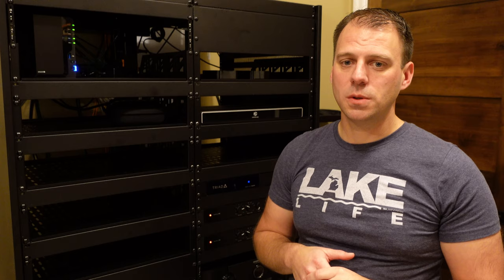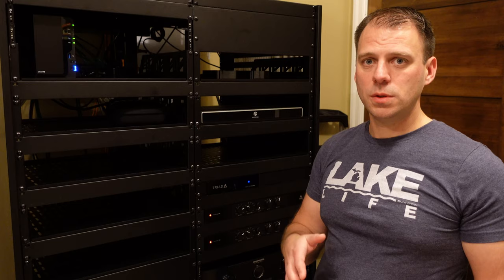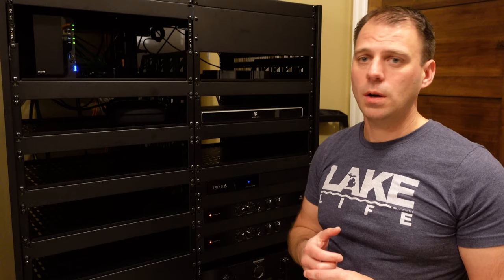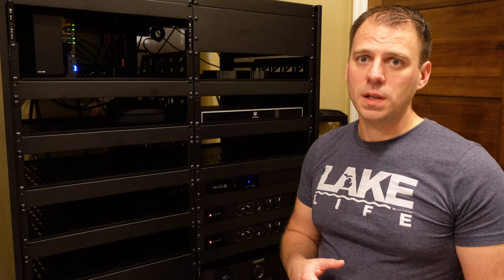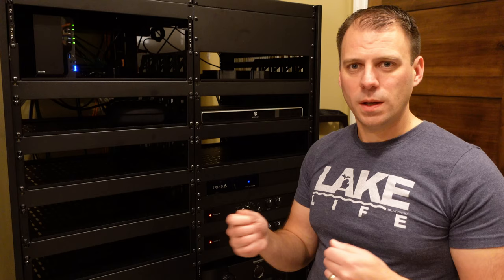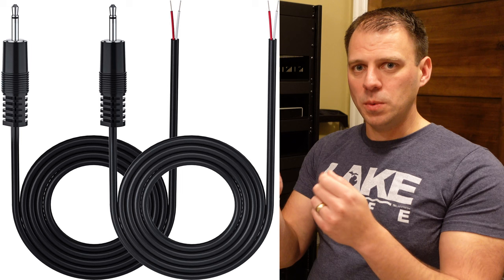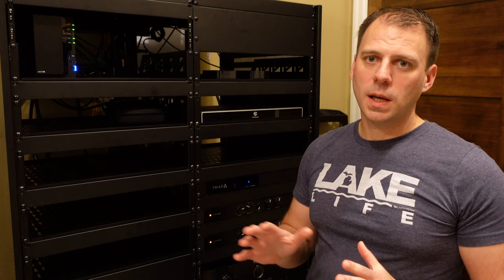For the living room, I'm using the triggers as well. The Marantz has two trigger outputs — trigger one is the main zone, trigger two is for the living room, set to go on and off when Zone 2 goes on and off. The Marantz has a 3.5mm 12-volt trigger port, and so does the Triad PAMP1, although the rack amps use screw terminals with Phoenix connectors. I had to get some special cables — I tried cutting up mono cables I already had, but the conductors were too small. A couple minutes on Amazon, a couple bucks later, I had thicker gauge cables that work with the Phoenix connectors. I'll put them up on screen and link them in the description.